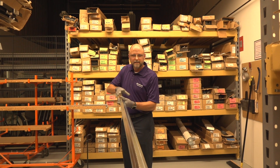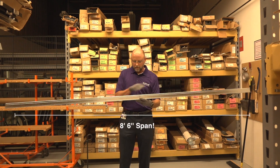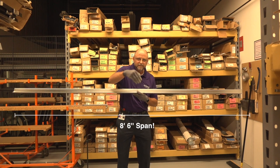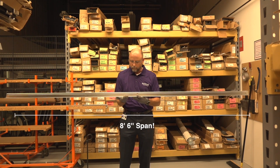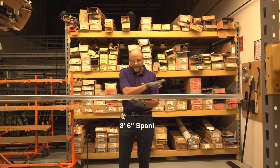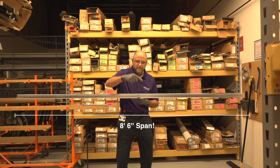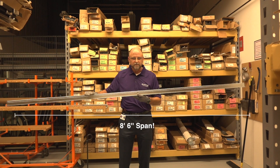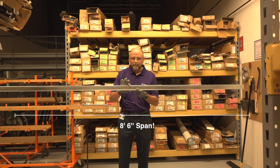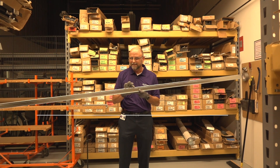This particular product can span eight foot six across the room with T's 16 inches on center. And it can span eight foot six with one layer of five-eighths inch drywall and no wires to structure. You're going right across the room at 16 inches on center, one layer of drywall, no support to structure — in a profile that's only an inch and 13 sixteenths in height.